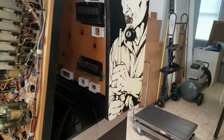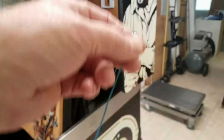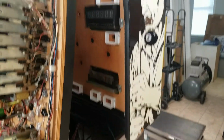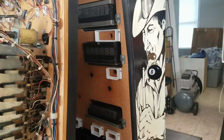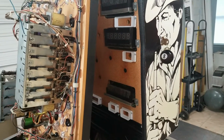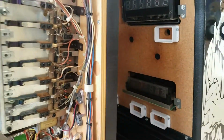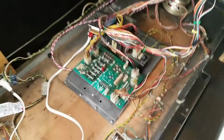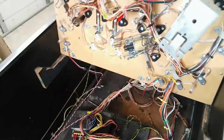So I'm up here at the box. I have a blue wire coming out of the bottom, this little thin blue wire, which is the wire that was on that connector, and I have plugged it into the card. I looked up the wire. The other side of this that powers this is the switched illumination bus, which comes from this connector right here, and it's a blue wire dead in the center of the thing.